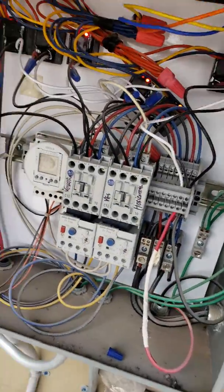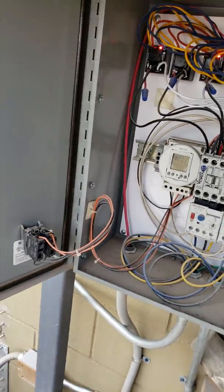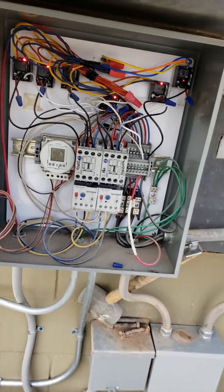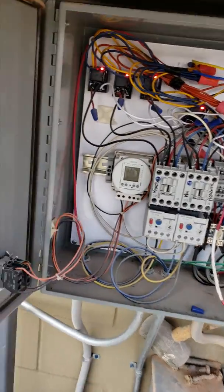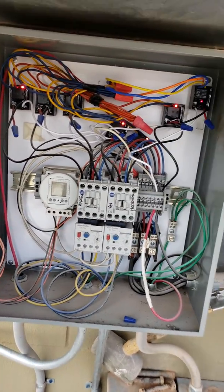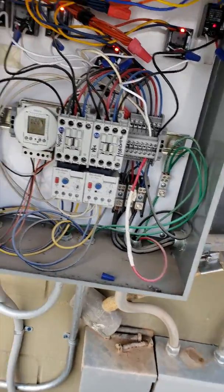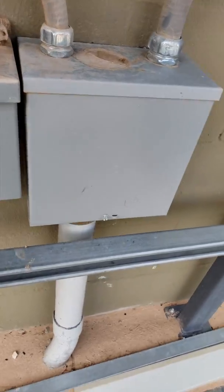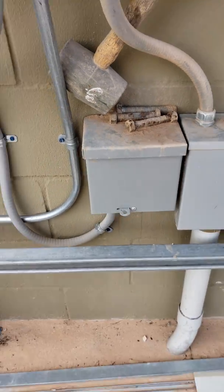Okay, it's important here that you have a fire alarm system. Okay, there's different kinds of fire alarm panels and stuff like that, but even if you're using an intelligent panel, where it's a SLC point addressing panel, or if you're using a standard zone panel, it really doesn't matter. So this is coming in. I installed this dude right here. On the other side of that's where I have my monitoring module.